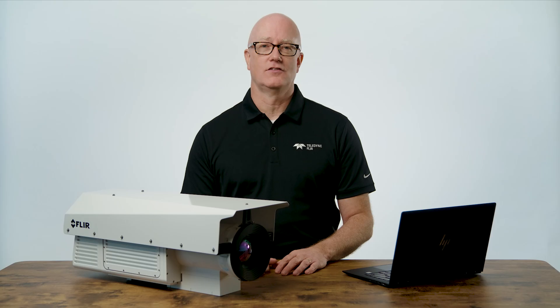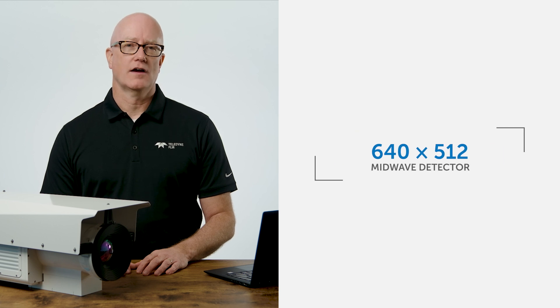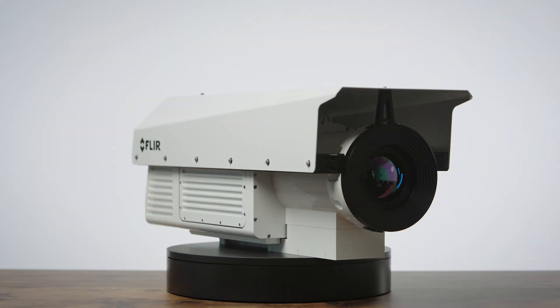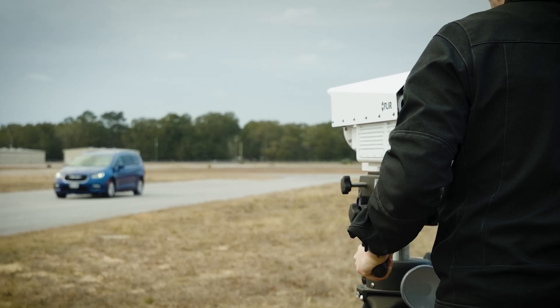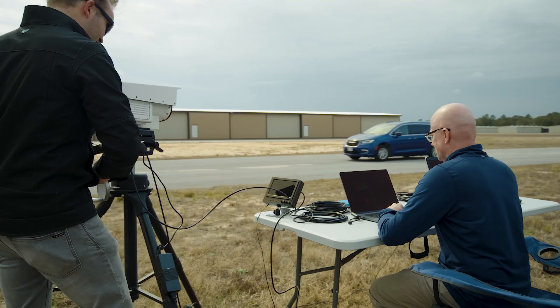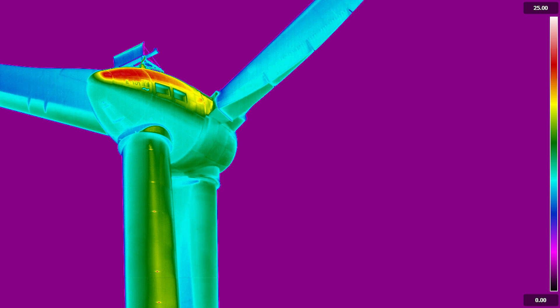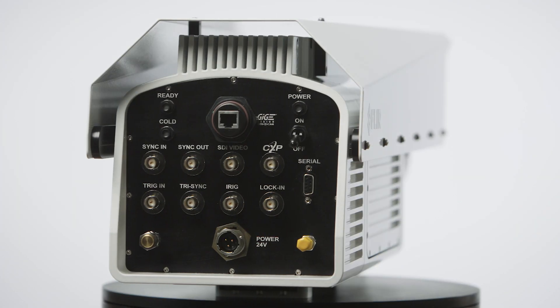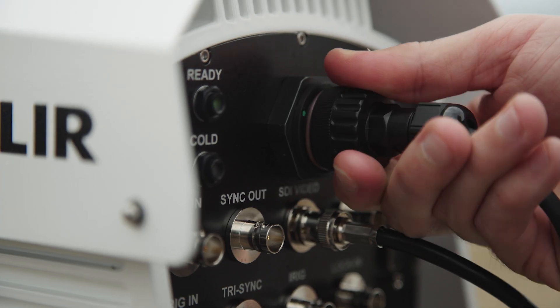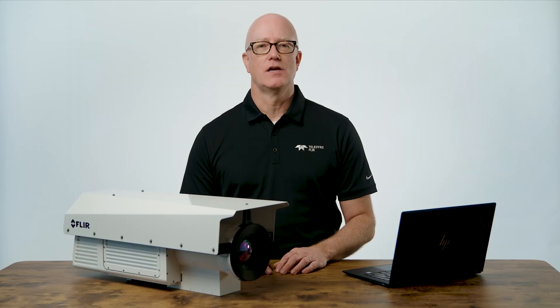Like the A6780 camera systems, the RS6780 uses a super sensitive 640 by 512 format mid-wave detector, which gives you over 327,000 temperature measurement pixels. Whether you need to measure a moving target or a fast thermal transient, the camera's fast frame rates and ability to run at over 4,000 frames per second means you'll never miss an important event. You can also discreetly control the frame timing and data output through triggering and synchronization inputs on the back of the camera, allowing you to record exactly the information you need to satisfy your testing requirements.